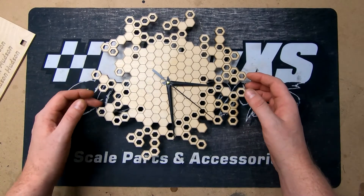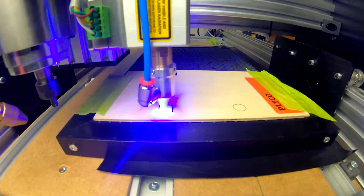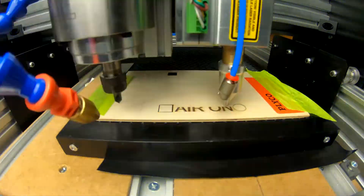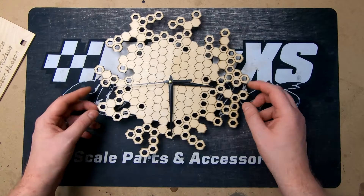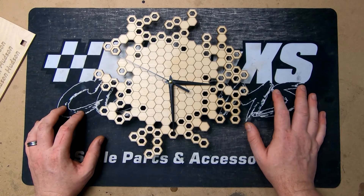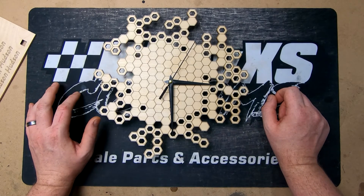Final thoughts on the u-spot lens: it's definitely increased the power a lot. We were having to run about 5 millimeters a second with about 10 passes to cut through this material — now we're doing double the speed and dropped a few passes. We could probably do it in about 8 passes with a little more tuning. A little more trial and error and we'll really dial in these settings now that we've got all the upgrades. If you guys want to check it out, the link is here — it's a big investment by the time you buy all the upgrades, but it's well worth it. Until the next video, have a good one.